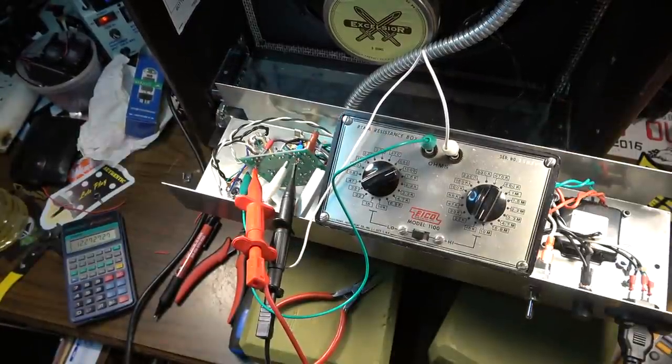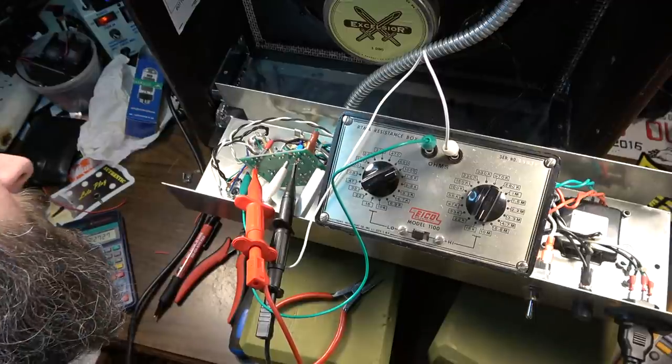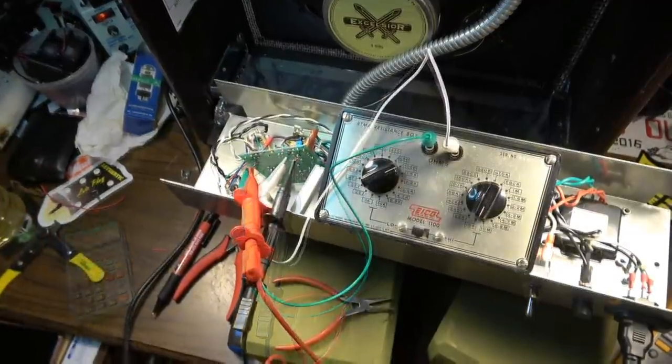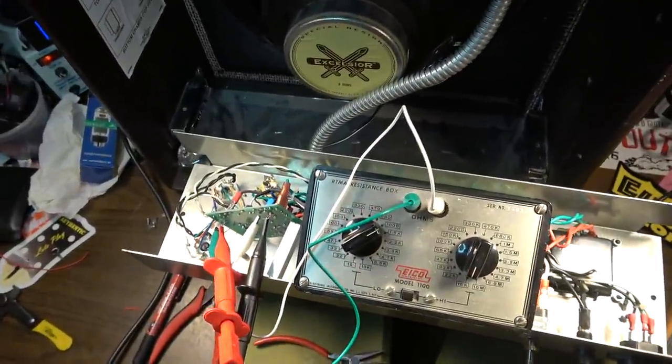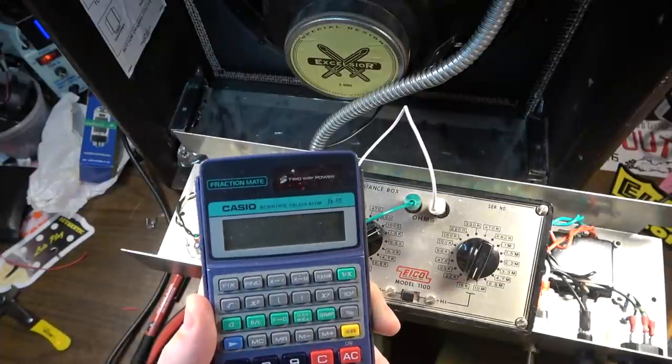resistances here. All right, so we've gone up to a 1K. That didn't bring our current down very much. We're at 37. It still seems like it's climbing up. Okay, so let's try this again with 1K. And we've got 36 volts of voltage drop. So we've got about actually 36.5.